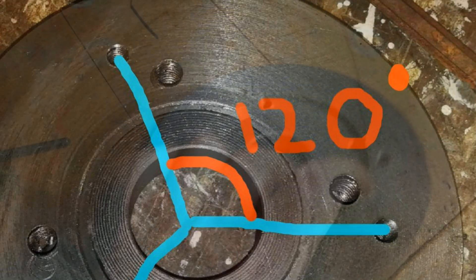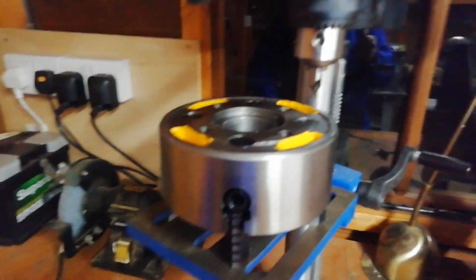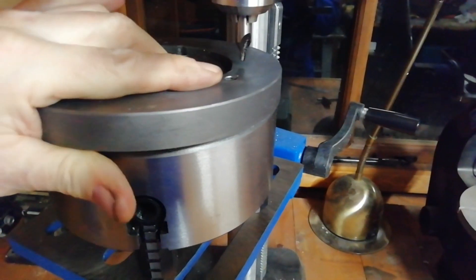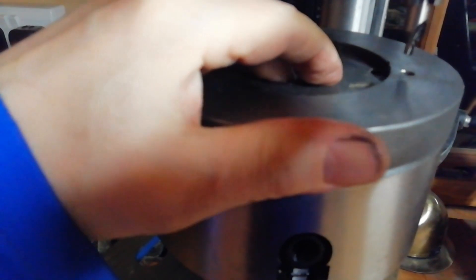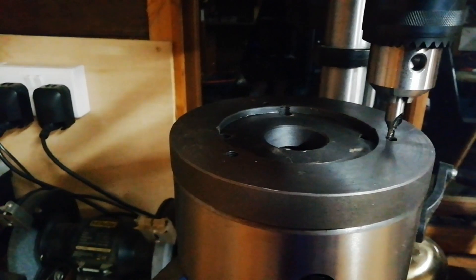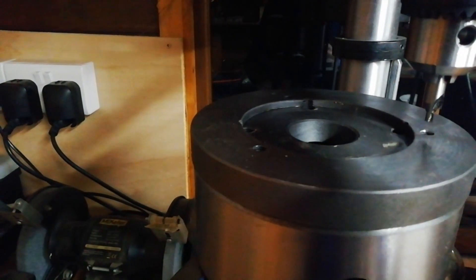This is the solution I came up with. I've put the four-jaw chuck on the drill press and I'm using the four-jaw chuck's recess so I can fit the adapter plate to the chuck and use it like a rotary table. Furthermore, by aligning this platform with the countersink drill, we know this is the correct distance away from the centre.